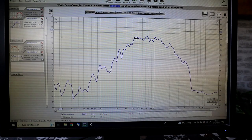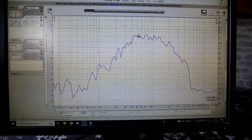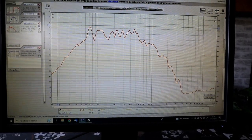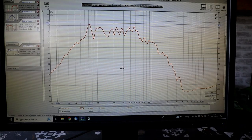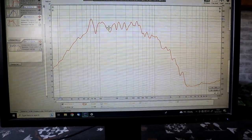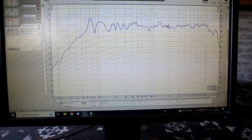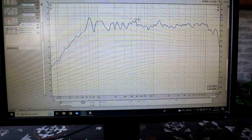The CX mid range is coming on at 475 Hz as specified, dropping off around about 1250 Hz — perfect. And the 15 inch comes on a little bit bumpy with room modes. This is how I'm going to listen to it — I don't bother trying to sort things in an anechoic chamber or take it outside. I did a little bit of tweaking to get this to run flat, could do a little bit more boost, but it's pretty flat and sounds pretty good. So the overall response is 80 dB pretty flat all the way, within a few dB — a bit wavered but that's room modes.